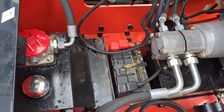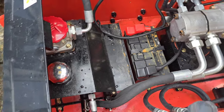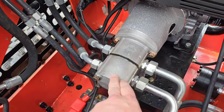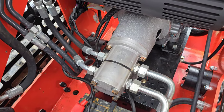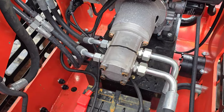Looking inside here, this front tank right here is all your hydraulic oil — that sits in the front. In the middle you have your battery strapped down, and then you have a dual pump setup on this. This thing has two pumps — the idea being one drives one track system and the other drives the other, so you have plenty of flow.